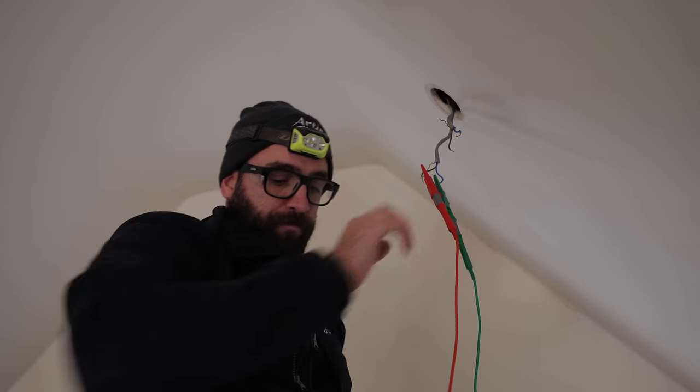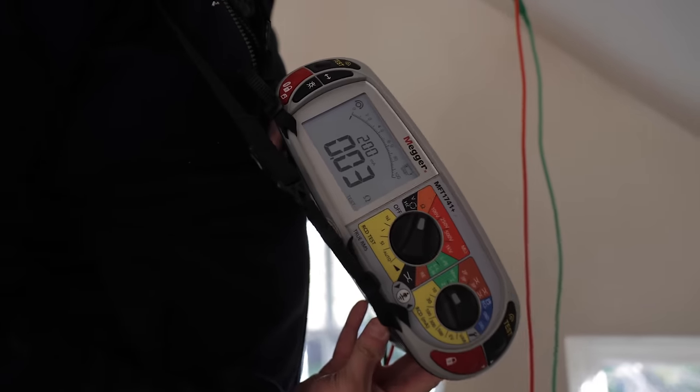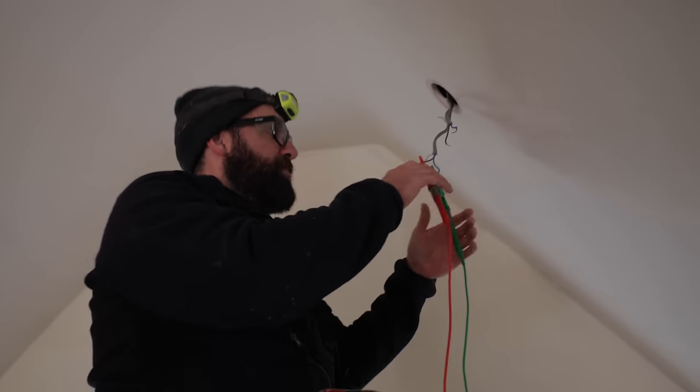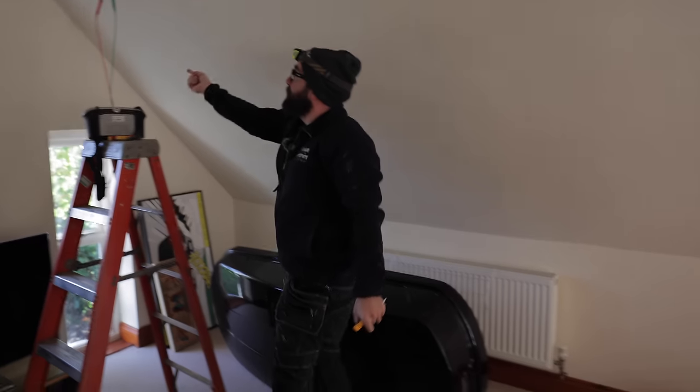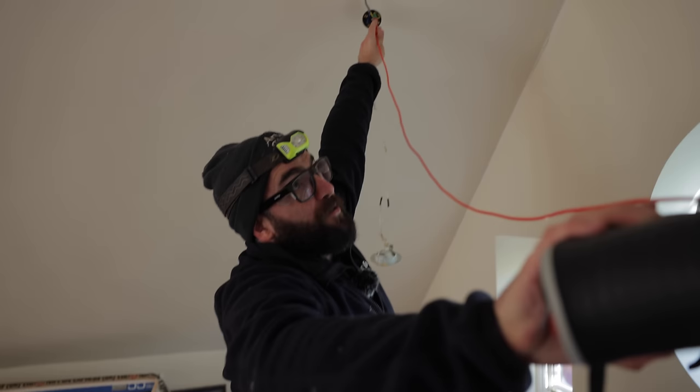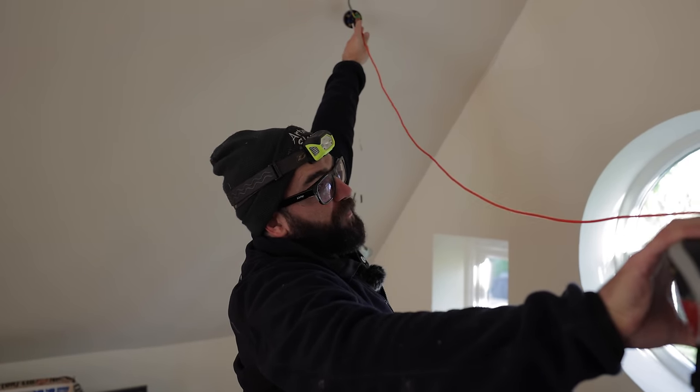Oh, now, remember we had 0.09? We're even closer to the fault. So it's this piece of cable here. So it's the cable going from here to there that's down by the looks of it. Just double check it. So that cable goes over to here. So the leg that's down is the one that goes from that to that one.